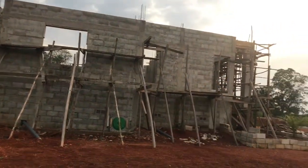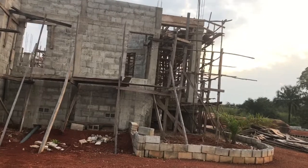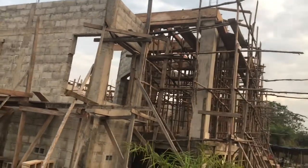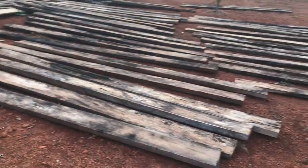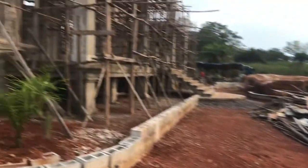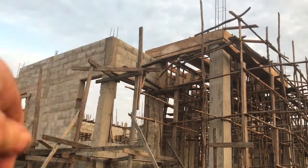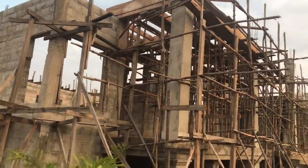The master bathroom and master bedroom are over here, and we have the deck beams I showed at the beginning of the video. The block will go up to the top of that board up there, and then we'll put these two-by-eights in. They've all been drying out right here, stacked up. There'll be bolts sticking up all the way around, and we'll place the two-by-eights over the bolts after drilling the holes and screwing them down. That way when the truss comes in over the top it has wood to sit on and not concrete.